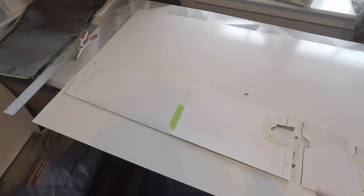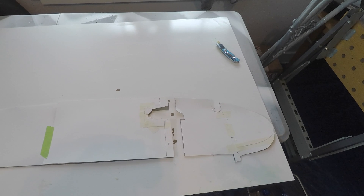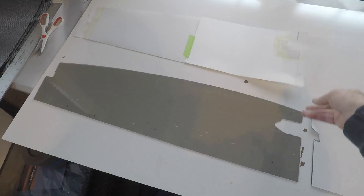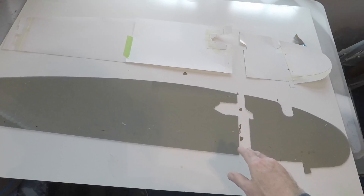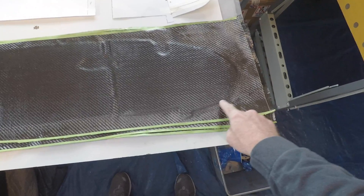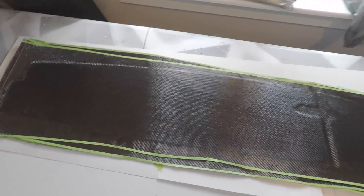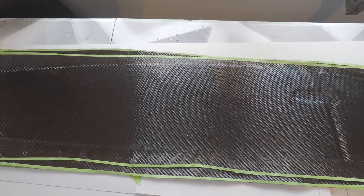I only need one poster board template because it'll be the same on both sides — I'll just flip it over. These will be made out of carbon fiber, and I will cast the carbon fiber over a piece of Lexan that I've cut out. I'll use peel ply tape to attach it to the board and then cast three layers of fiberglass over that. The purpose of using the Lexan is to give it a ridge so that when it's all done I've got a perfect line to follow when I do my cutting. The end product will be a nice carbon fiber finish, and then the sight gauge will go here and I'll be able to label everything for the sight gauge.